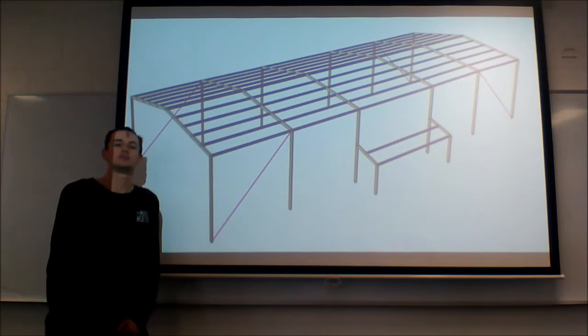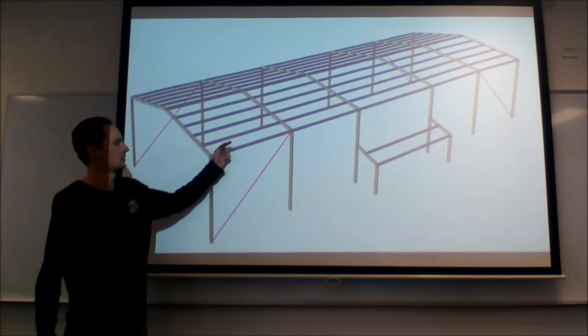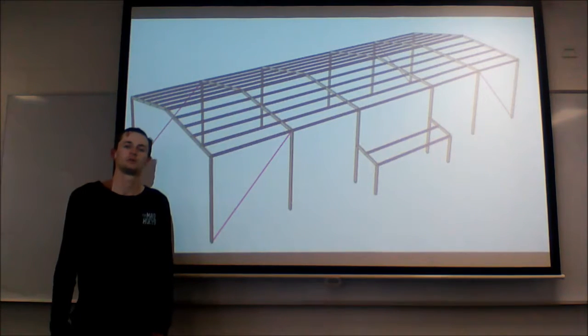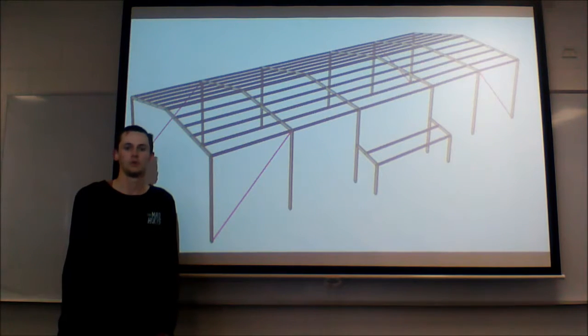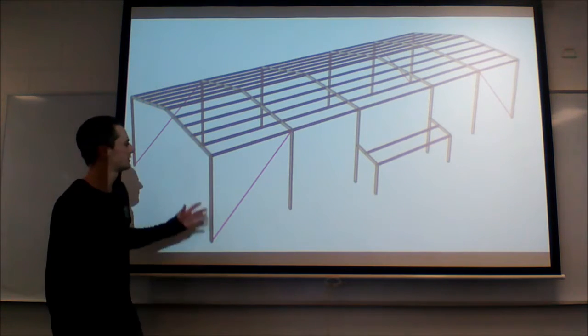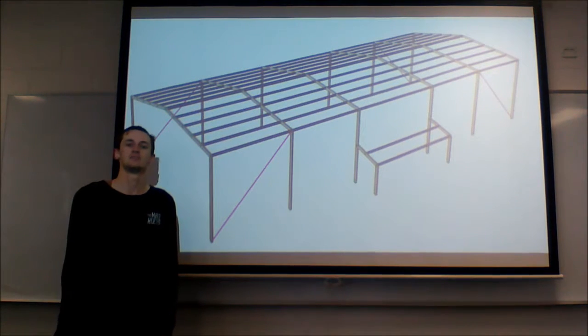My name is Ben, and I'm one of the engineers who helped develop the portal frame structure of the table tennis facility. After the rafter considerations, columns had to be analysed and designed. The initial parameter that had to be considered was whether a universal beam or a universal column should be chosen. After several iterations, MBSML Engineering found that a universal beam would be the best option, as the universal column was found to be insufficient in taking the same bending forces as the beam, which in turn led to a more expensive member which had to be used. Subsequently, design and analysis procedures found that a 310 UB32 is the most economical but safest member that could be used to support the structure.